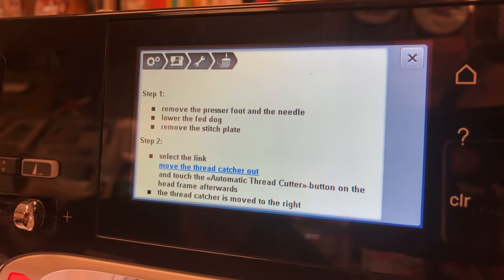Don't over-tighten your needle screw. If you over-tighten it, the tip of the needle screw can break off and jam everything up — this could be a two to three hundred dollar issue. The tip should be nice and tapered; if you take the screw all the way out and it's flat and broken off, it's time to see your dealer. You want it tight enough so it won't come out, but don't white-knuckle tighten that screw.